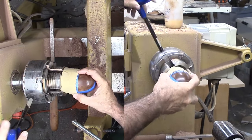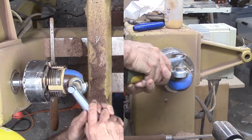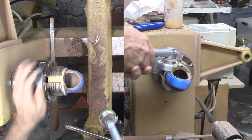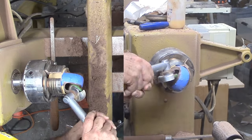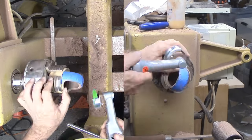Now to carve the handle. I've applied tape around the bottom and across the top. I'll carve out the two sides of the top. I've wrapped some old router pad around the egg and gently mounted it into my shark jaws. From here, I'll carve with a Proxxon with a coarse rasp cutter. The tape marks my edges. Then a lot of hand sanding to clean up the edges before applying finish.